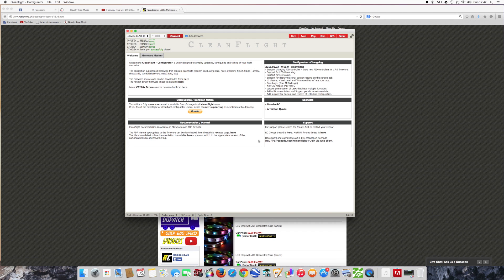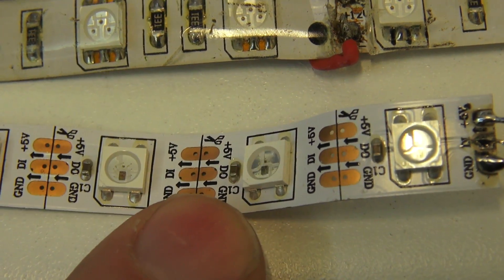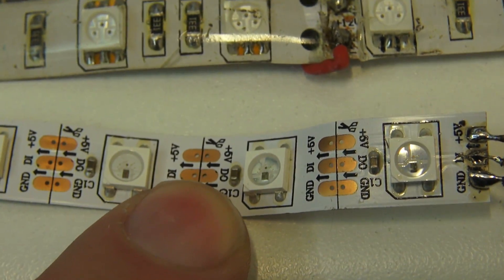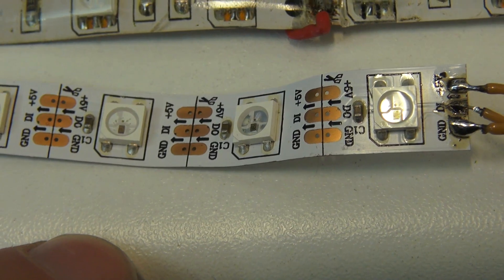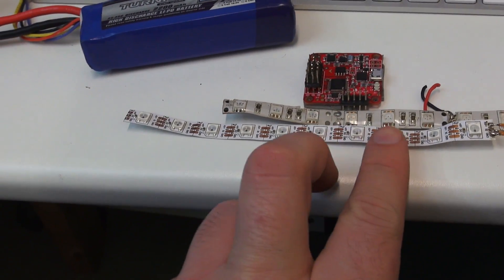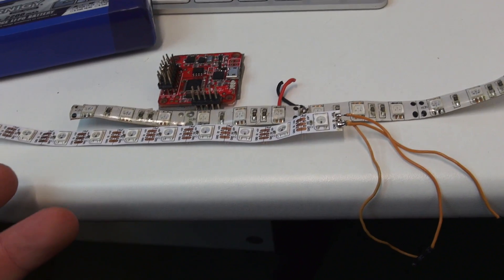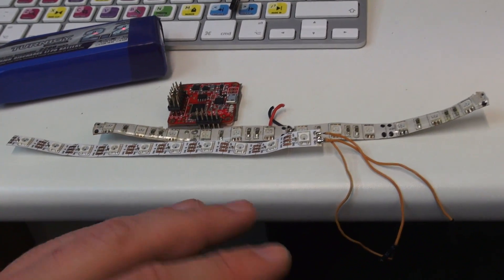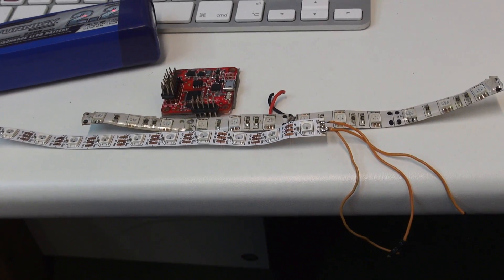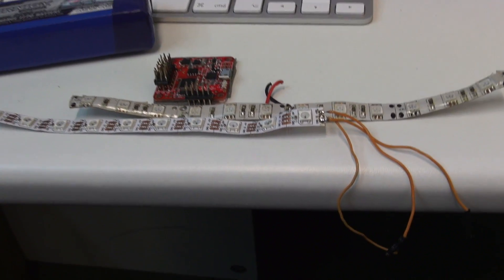I'm running the CleanFlight system open, and that's what I'm using to program these particular LEDs. If we have a little look on the LEDs themselves, you can see we've got a ground, the middle is our signal, and then we have our 5-volts on the other side. You can actually cut these every one of them. What's nice about this is you can fully program through CleanFlight all of these LEDs to show a particular colour and to do a particular thing - so if you arm your board, you can have all of the LEDs change to a certain colour to let you know your board is now armed and active. Including orientation lights, throttle differences and things - so as you put your throttle up, it changes.